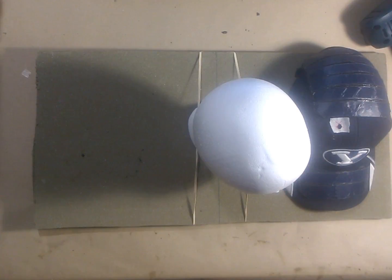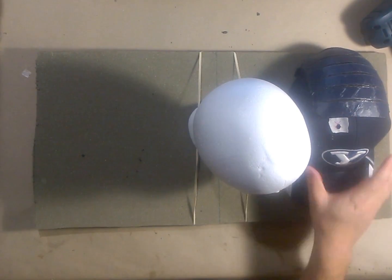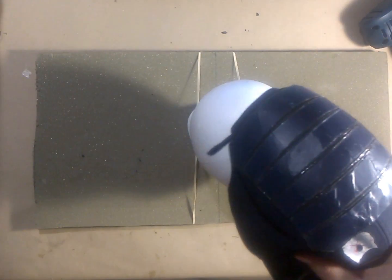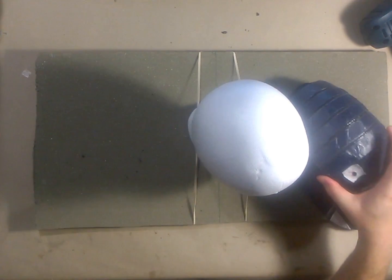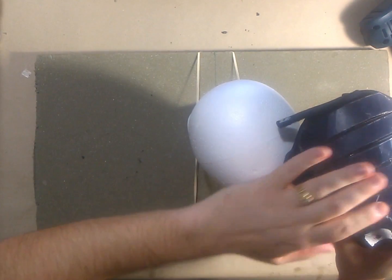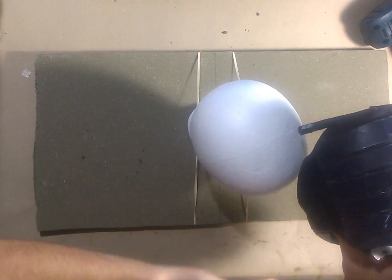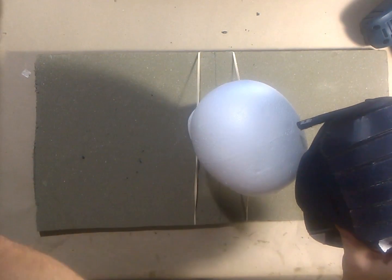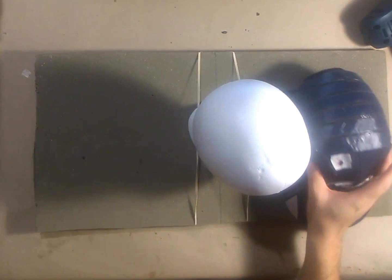I'm going to do some more tests, but I wanted you guys to see this first one. This hat is broken — it was broken before I did this. See all these dents? I beat on it with a hammer, and I'll probably include that in the final cut of this video. The solar cells stopped working about halfway through the hammer test, but it survived throwing it at the pavement and worked fine after that. Because of that, I changed the way these work — in future models, we add another protective layer to the solar cells, and we wire them in a redundant scheme: half the cells in series, half in parallel. That means it continues to work even if some wires break.